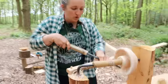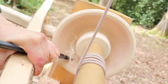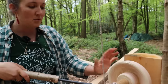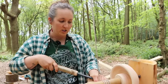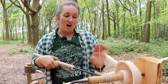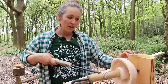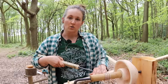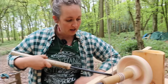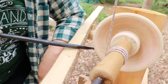Because if I keep my tool pressed the whole time, you can hear it bouncing around, versus, you can still hear it bumping the wood a little bit. So I'm not moving it away that much, but I am pulsing. You are applying the tool to the wood. Oftentimes it almost feels like it's floating in space and the cutting edge is just engaging with the wood. You do not want the tool referencing the wood a whole lot, because then it will influence the finish of your bowl. So that pulsing with your leg and the tool is important. And it comes with practice and time. Does that cover it? Yeah?